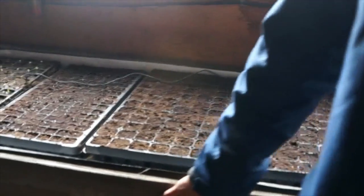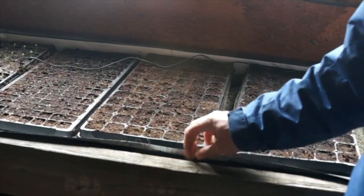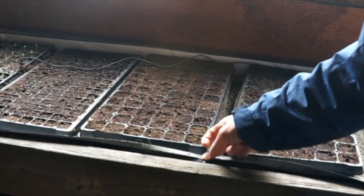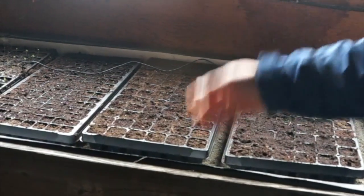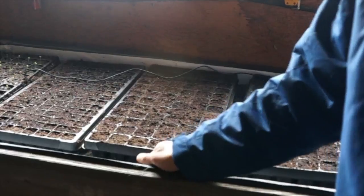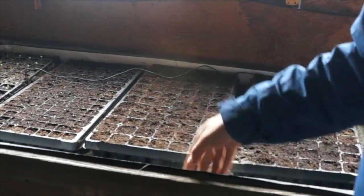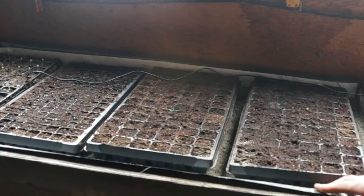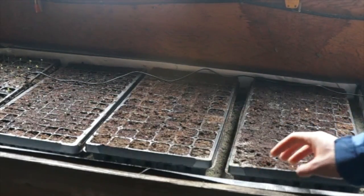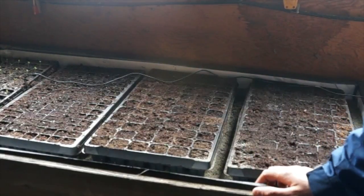This is how I built it. I have two-by-six framing and then a liner — the liner is five mil panda film, just some leftovers I had. Inside is moistened sand, which is a good heat conductor; I got it from a local gravel yard for about three bucks. Underneath is about two inches of solid insulation to prevent heat loss, and on top of that insulation, snaked back and forth, is some de-icing cable.